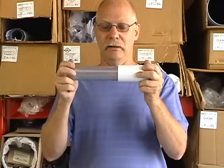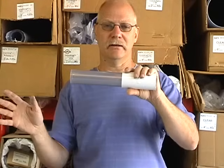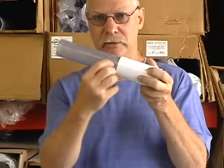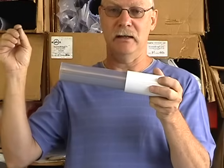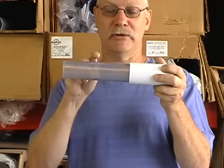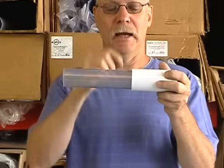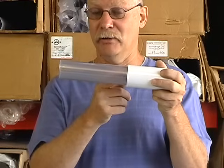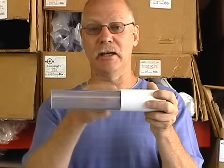Here's the easiest way — suction. If you have a leak on the suction side, your pump is over here, here's your source, water goes this way. This is extremely easy to fix. All you do is turn on the pump and let it run, then take primer and dab it all the way around the joint. If you're really observant, you'll actually hear a slight change in the pump when you put the dauber right where the leak is, because right now it's sucking air in. When you put your dauber over it, it'll go quiet for a second — that tells you exactly where the leak is.